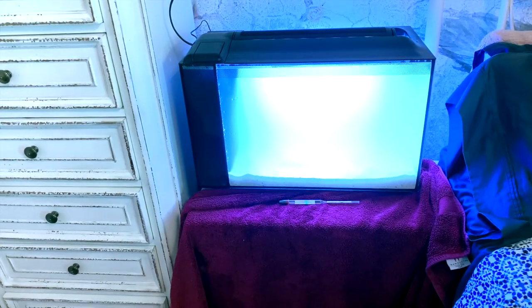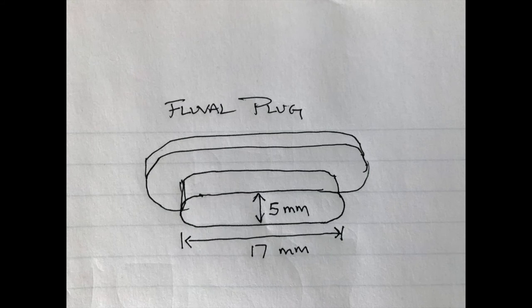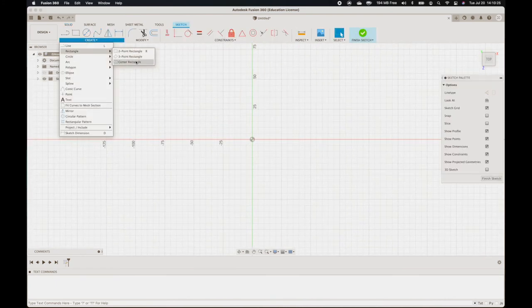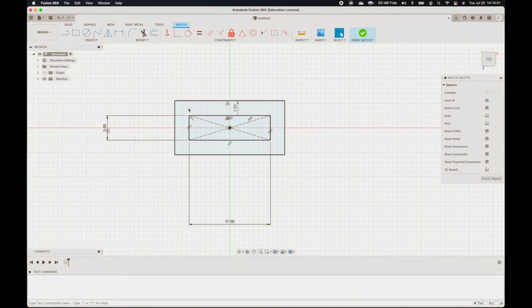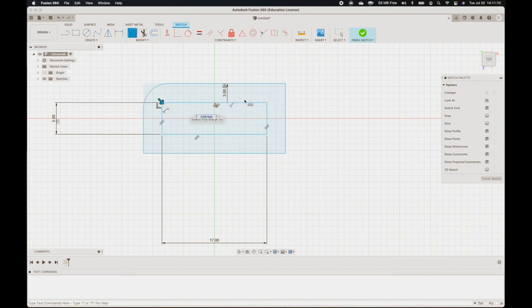While we wait for the tank to clear, I took some measurements: the bypass plug needs to be 17 millimeters long and 5 millimeters high. We'll go to Fusion 360, start a new sketch, do a center point rectangle and set the dimensions to 5 millimeters by 17 millimeters. Then we'll offset that by 3 millimeters. This is going to be the base — then we'll fillet the sides. Actually, I don't like these extra lines, let's get rid of those.